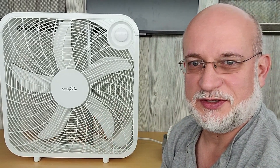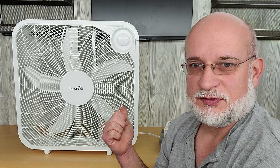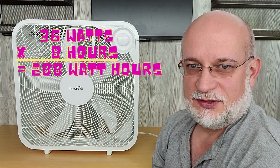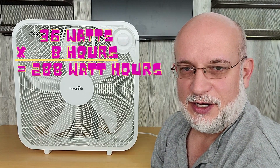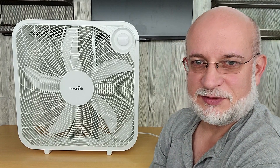In summary, this fan used 36 watts to run on low, so that's 36 watt-hours per hour. We ran it for eight hours, so 36 times 8 is 288 watt-hours — and the meter showed 0.28 kilowatt-hours, which matches. The math is pretty easy. If you ran it 10 hours, you'd just multiply 36 watts times 10 for 360 watt-hours.